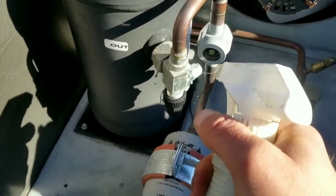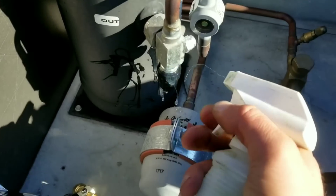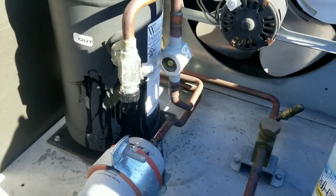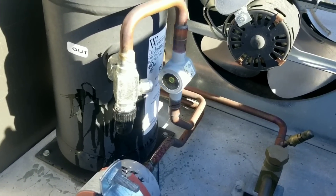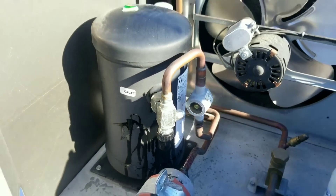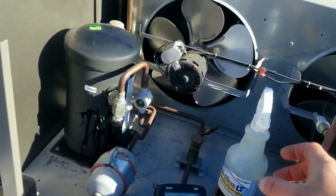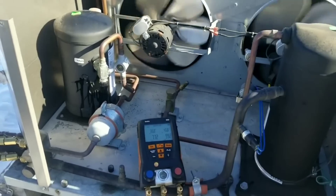It is really cold out here and who knows, my leak detector could be messing up. Anyway, I took the cap off my king valve, tightened up that packing gland, and there's no more bubbles coming out of the port on the side there. You'll see a lot of bubbles on there but that's just air trapped as I was screwing the cap back on. We are free and clear - confirmed with bubbles when I was done. Of course we're gonna power it on and add some refrigerant gas.